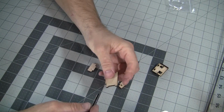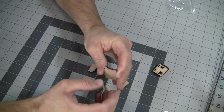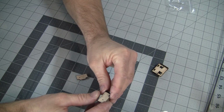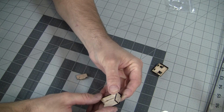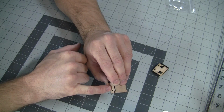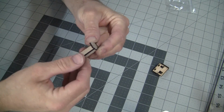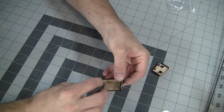This is very simple. This is sort of like the flight test firewalls that they build. Just want to line these up. You want to put the holes towards the front so the camera doesn't hit the back wall when it tilts. Now on mine, I actually drilled the hole a little bit farther back in order to put the camera a little farther back this way. That helped to protect the camera in a crash, but it also restricts your tilt angle. It doesn't allow you to tilt up as far.